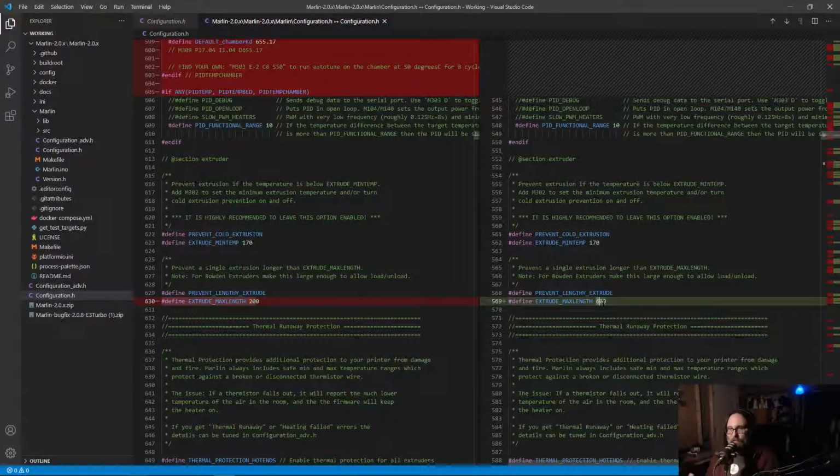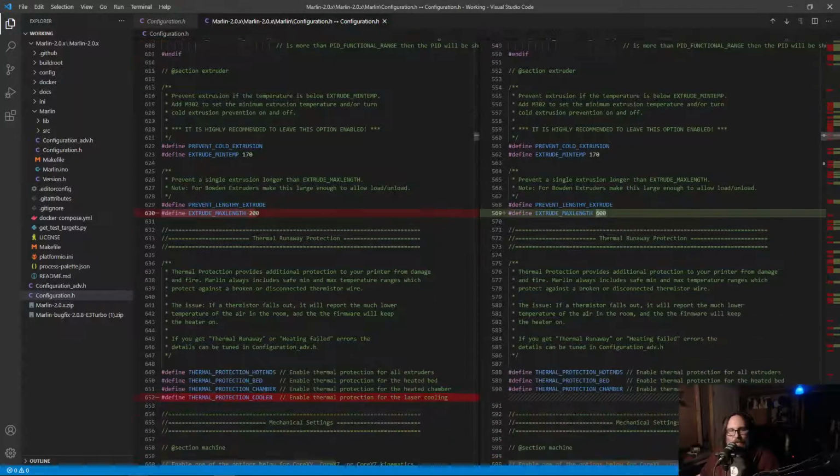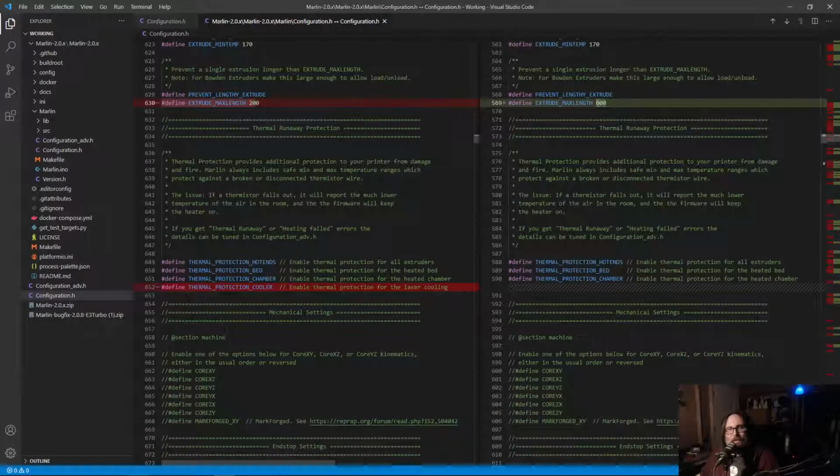So if you set it a bit higher than you want, 600 isn't bad. You might lose a little filament there, but on a CR10 or bigger, you're actually getting the filament all the way down to the hot end, as opposed to 200 where you're only halfway down the Bowden tube. So that's my logic for that, but it hasn't changed. It's still there.